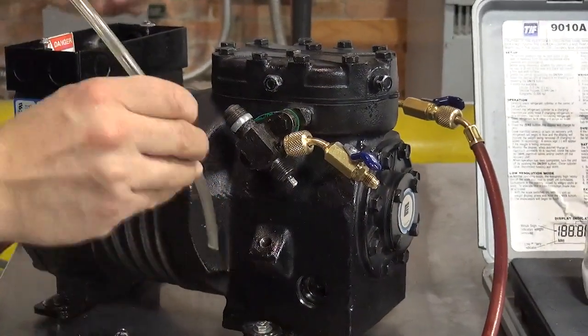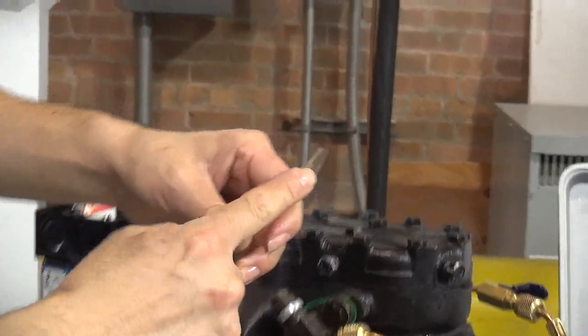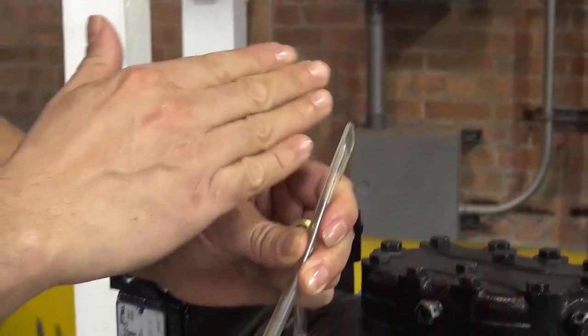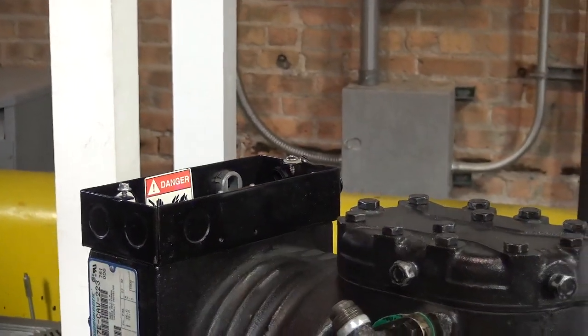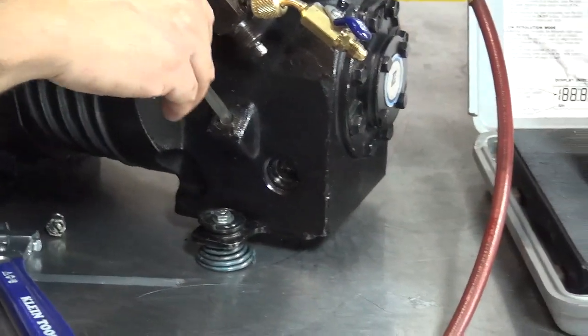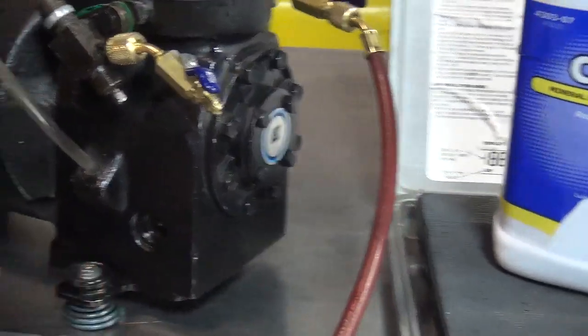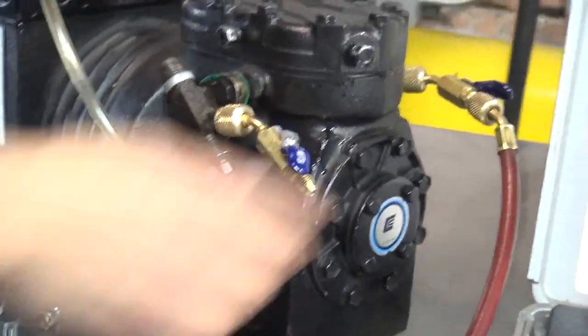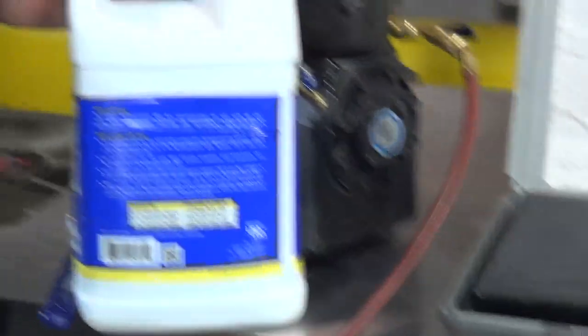And this hose has a cut. See that? It has like a 45-degree, or maybe more than a 45-degree cut angle. So what I would do is bring the hose inside the compressor crankcase and try to get all that oil from the bottom of the crankcase of the compressor. Okay? Now, we don't need this oil anymore. Let's cap it.